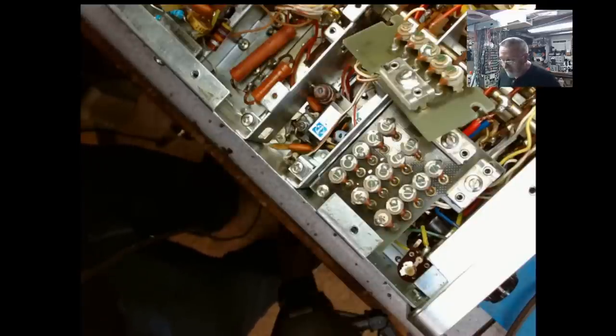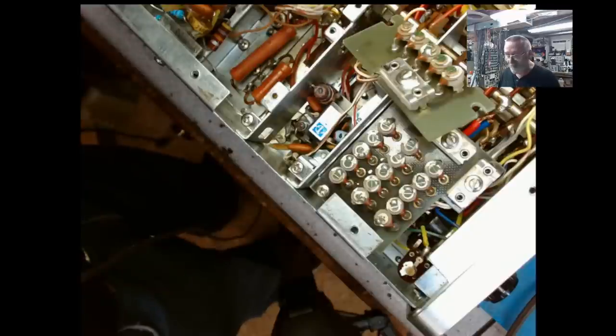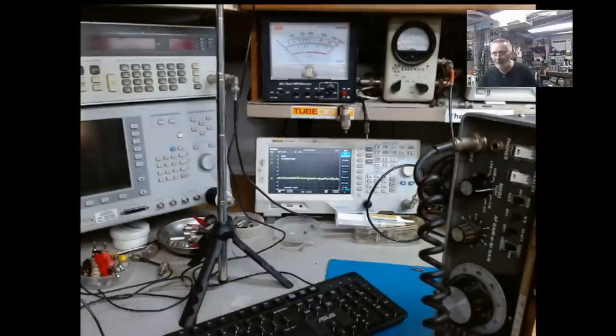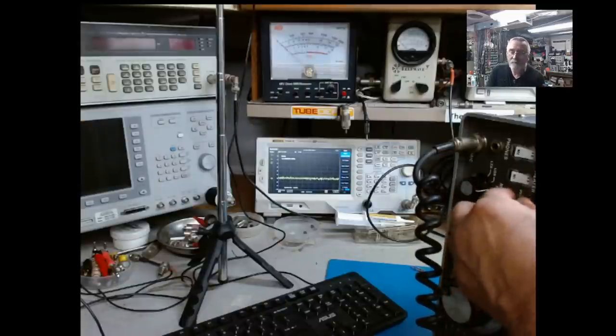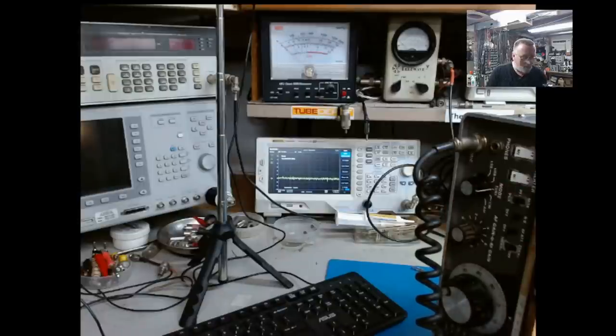Okay guys, all that's back together. The radio's not tuned up so I'm going to just hit the mark switch — got it on tuned. Let me turn the carrier down about halfway. Oh yes — that is now working! I can go ahead and get this radio tuned up. I need to put the shields back on — the tube shield and the shield on the bottom — and case in as much as I can, because when I start going full power into the dummy load, if the computer is too close it locks the USB ports out and the mouse and keyboard don't work.